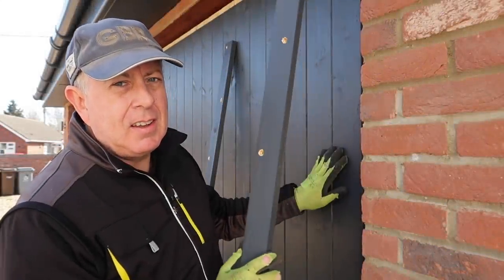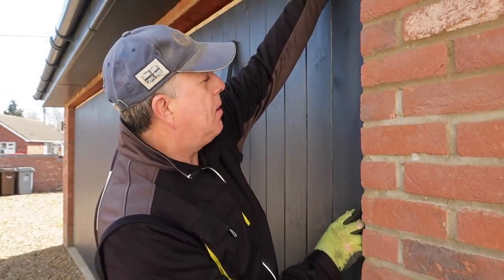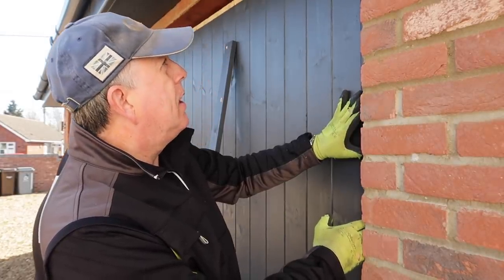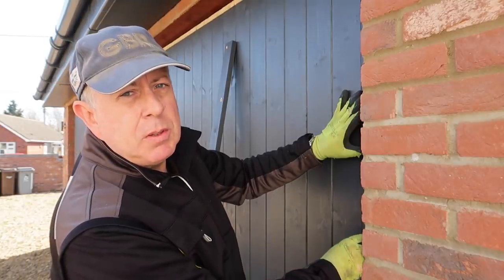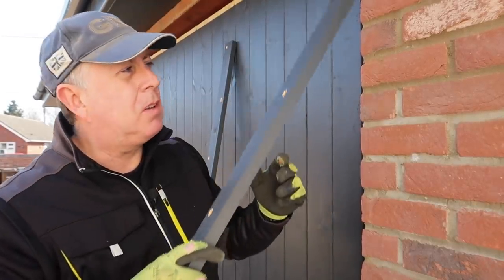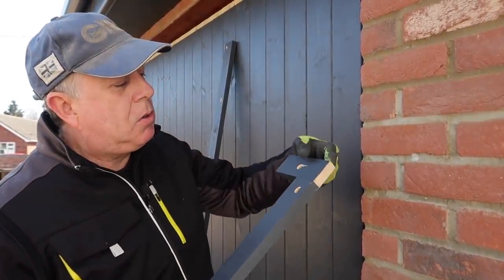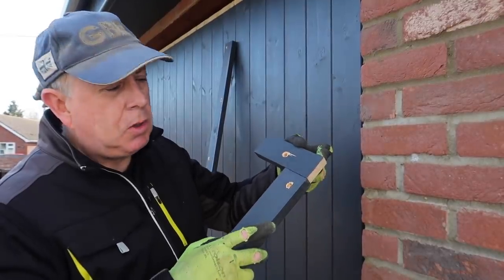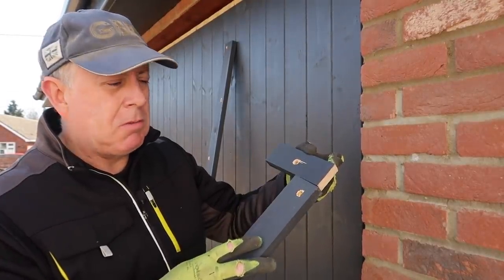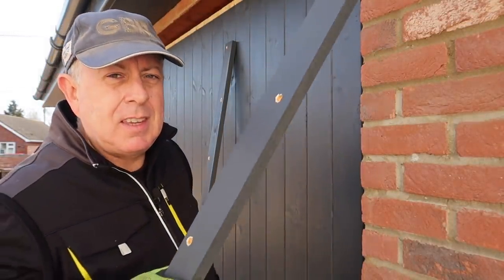So now I've finished the cladding, I can fix the trim around the outside — this is just going all around the perimeter, a bit like a frame around a painting. I'm still going to have a 20mm gap between this trim and the brickwork on either side and the steel beam at the top, and probably a 30-40mm gap at the bottom. From a few meters away I don't think you'll see that; it's just going to look like a shadow gap. What it does do is keep this away from all the surfaces, keep it drier and hopefully extend its life. On each corner I'm going to be putting a simple butt joint. I'm not going to mitre it because I think this timber over the next few months is going to shrink and any mitre I put in is just going to open up and look a bit rubbish.